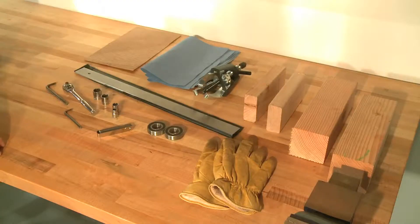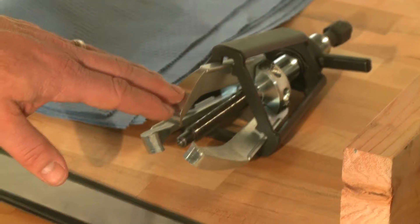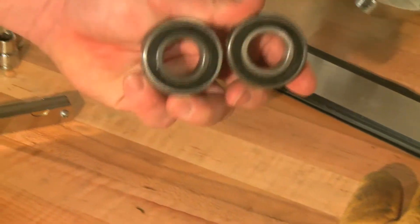As with any job, you're going to need to have certain tools available. Keep this in mind before you start because you don't want to get halfway in and then discover that you're missing something and have to walk away from your machine when it's taken apart. The complete list of all the tools you'll need are included inside of the instructions that come with your new spiral cutter head. Most of these tools you probably already have. The two critical items are a gear or pulley puller and new bearings for the cutter head.